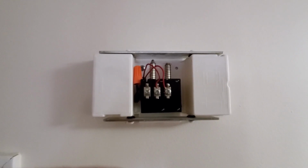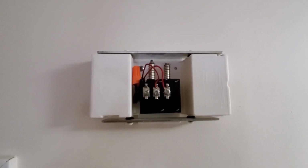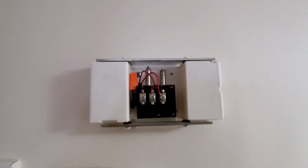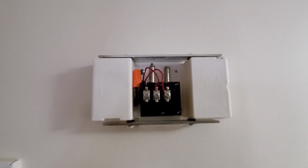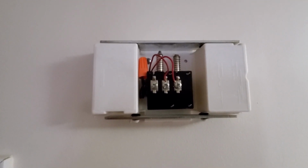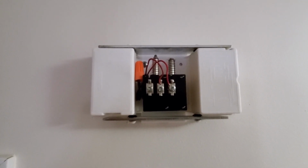It doesn't matter what kind of wiring, but if you have wiring, generally your Google Nest Hello doorbell should be compatible. But if you only see batteries here and no wiring, their website says that that type of chime unit is not compatible. In here I don't see any batteries, it's just wiring. So according to the website of Google Nest Hello, this should be compatible.